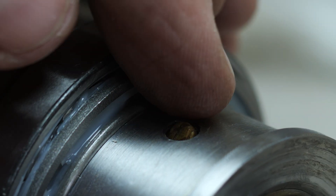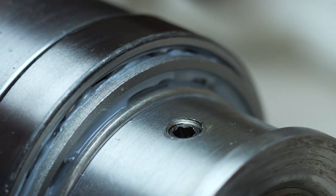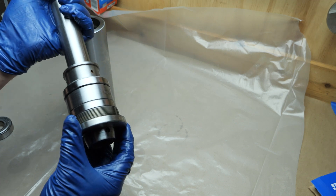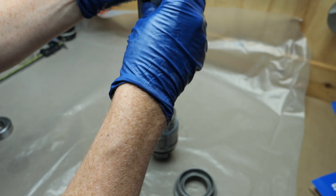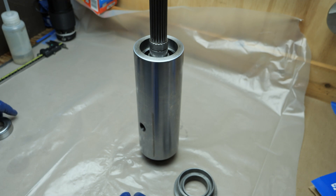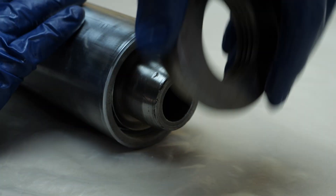This is the little brass plug that goes underneath that set screw — you don't want to over-tighten that or you'll actually distort the lock nut and screw everything up. You can see that the spindle nut, that left-hand threaded nut, has an oil reservoir down in the bottom of it, which makes me feel like this whole system is designed more for oil than for grease. But the whole thing went together fairly easily. I heated up the spindle cartridge housing and that made it slip over the outer races of the bearings pretty easily.